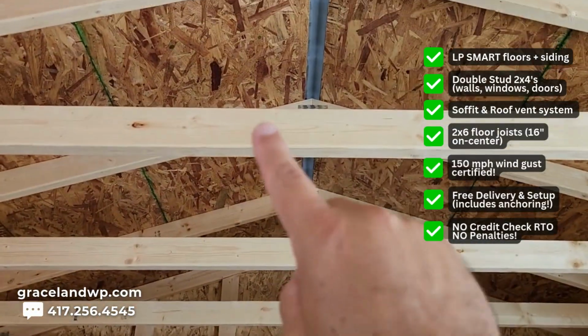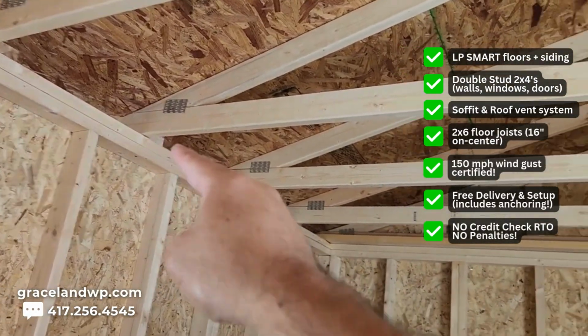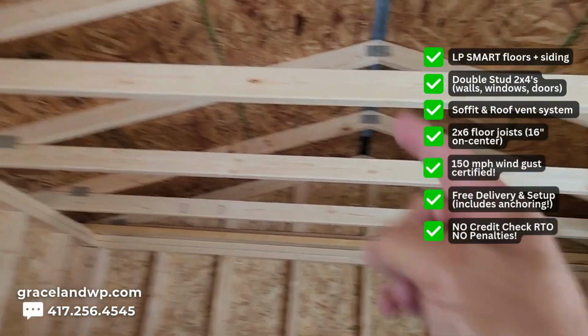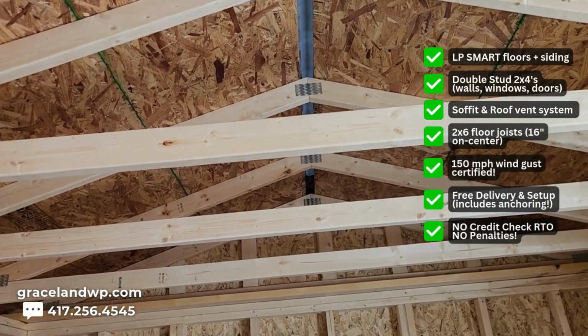Other companies don't do a triangle roof truss. The base of the roof truss rests on the top of their walls. They use a smaller base and they put it up higher. It saves them money, but our roof trusses provide extra lateral support that theirs do not. So we build a better quality building.